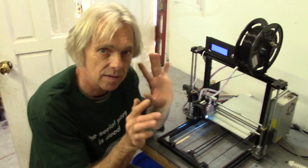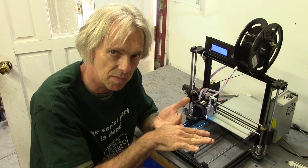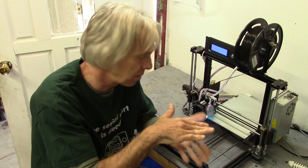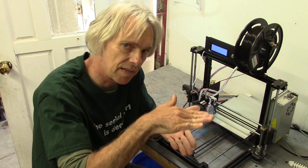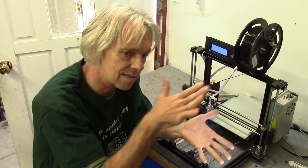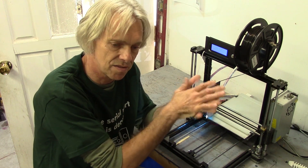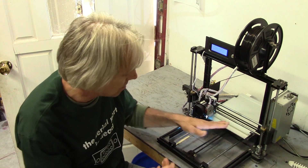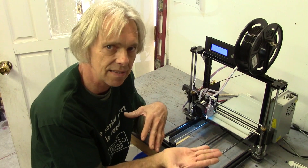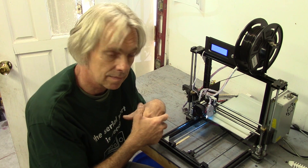It triggers the board to stop the Z from moving. After that, you need to calibrate it and move the sensor up and down until you get just the right height for your printhead. What was happening is it crashes into the glass. People have tried other solutions like putting aluminum foil underneath the glass, and I came up with a solution one day, kind of by accident. Let's take a look.